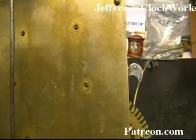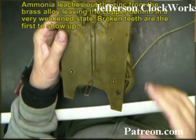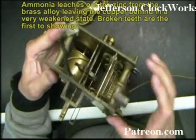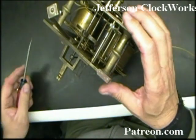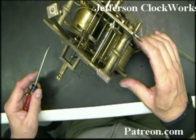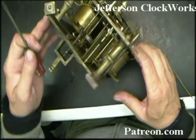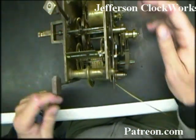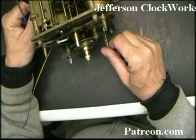You'll be able to see a bush right there in the center. First thing we'll be doing is taking off the verge here, get that out of the way so we can lay this unit flat on the back plate. Very old brass. This is not the type of brass that you want to put in an ultrasonic cleaner — this one you want to clean by hand. It won't shine up because old brass just simply didn't shine like the new type of brass. This is like battleship brass.